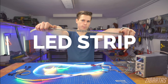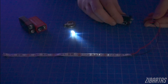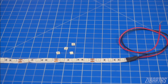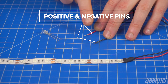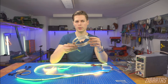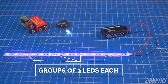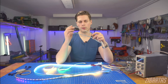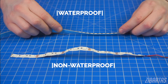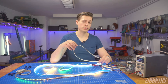Second: single color LED strip. Now this is the meat and potatoes of lighting. They're as simple to use as single LEDs, but can provide way more light. They're made up of groups of SMD LEDs — the surface mount ones — soldered to a common base. Single color LED strips have only two contacts, just like individual LEDs, but since they're wired up in groups, they require more power. Usually they need 9 to 12 volts, but you can get 9-volt batteries and they'll work fine. LED strips come in different grades of waterproofing, and even though I don't go swimming with my props or costumes, I still buy the waterproof variety when I can. There's a thin transparent layer of plastic on top of the LEDs that makes it more resilient to twisting, bending, and other mechanical damage, and it prolongs the life of the LED strip.